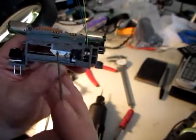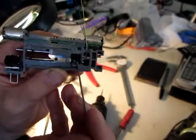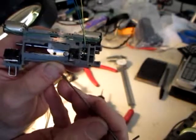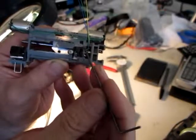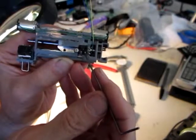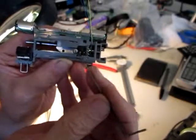So the motor comes down, the shaft hits the switch and opens the contact, and of course it stops the motor. The trick is, as long as this shaft is resting against the switch, it can't go back the other way. So even if I reverse the polarity, it's sitting against the switch and it won't allow it to go back, because the switch is now open. In order to get it to go off the switch and start back in the other direction, you need to put a diode. What you do is put a diode so that when you reverse the polarity, it allows the motor to run only for that instant to get it off the switch. Once it's off the switch and moving, the diode's no longer in the circuit, and it will run up to the other end and do the same thing at the bottom or the top.